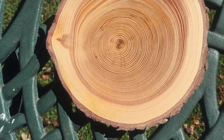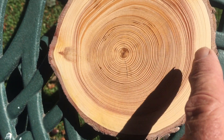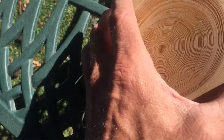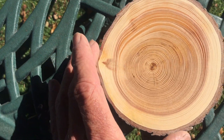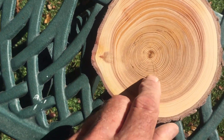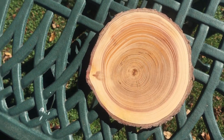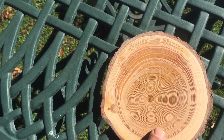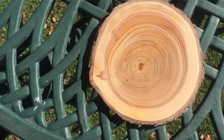What I'm trying to do is clearly delineate each of the individual rings in this limb, which is hard to do. To stabilize it before all this, I microwaved it for three or four minutes, about 30 seconds at a time, letting it cool between rounds. I got a tiny little crack in it, but it's very difficult to take a disc of wood and get it dry enough so that shrinkage doesn't cause it to split to pieces.